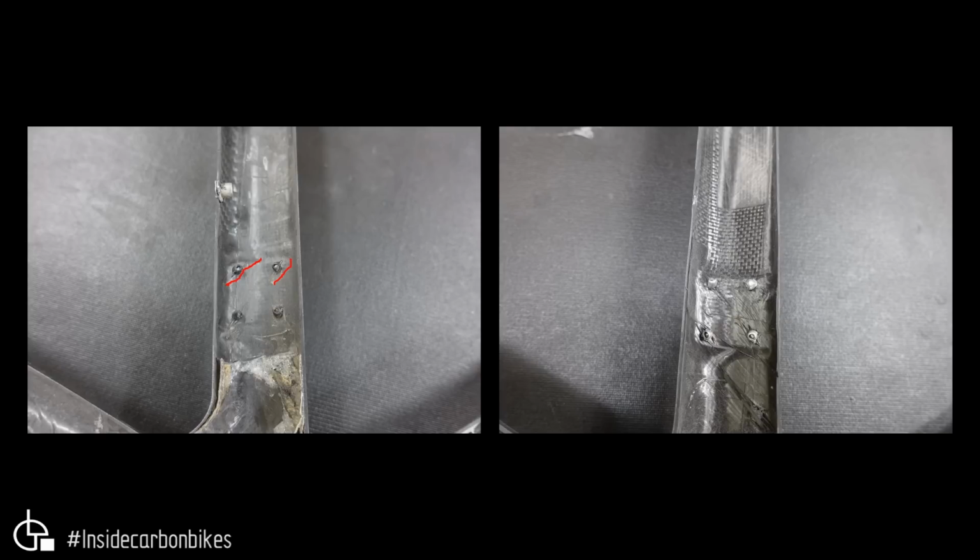Well, let's have a look at the fake. You can see it looks quite rough through there. Now the really interesting thing is they've gone to the trouble of cutting a woven fabric ply to stop splintering, but they've put it in the wrong place, so it's above where it needs to be, and then you've got splintering, but also some wrinkling through here.